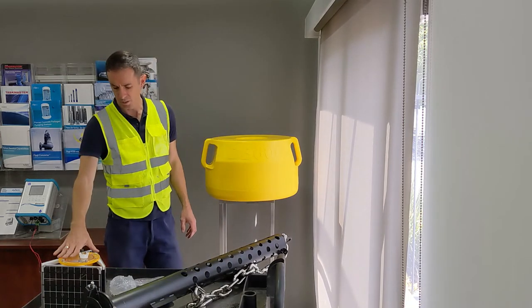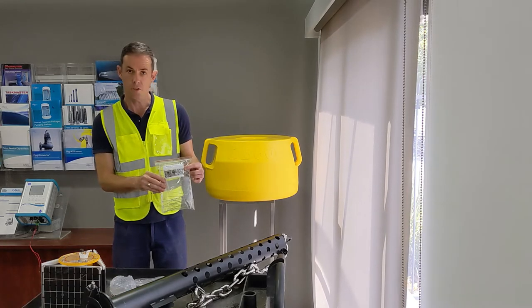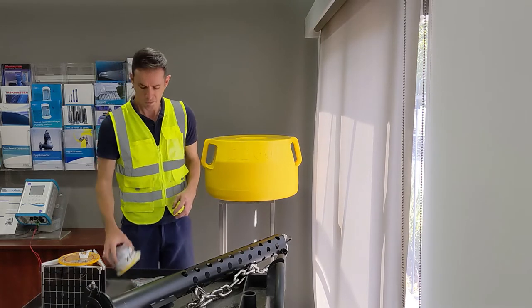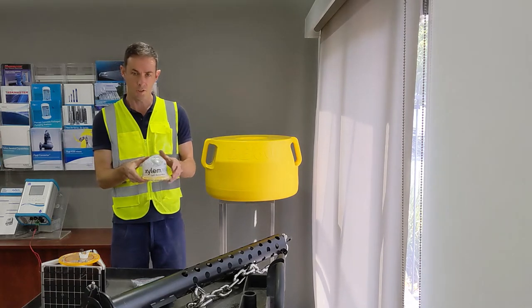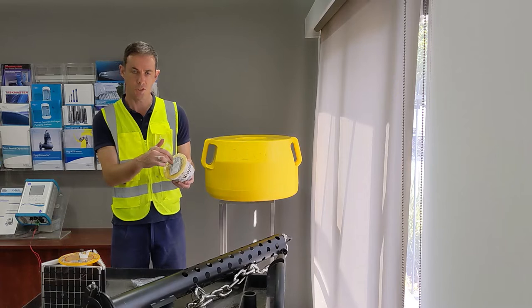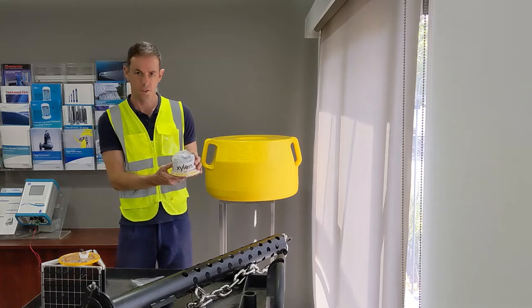The AR-1 box has many components inside. There are bird spikes with a QR code on how to assemble them on top. There is also a navigation lantern — when shipped, the lantern is switched off internally, so you need to unpackage it, take the base plate off, and turn the switch inside back on. Make sure you do that, or the lantern will not flash once you deploy the system.